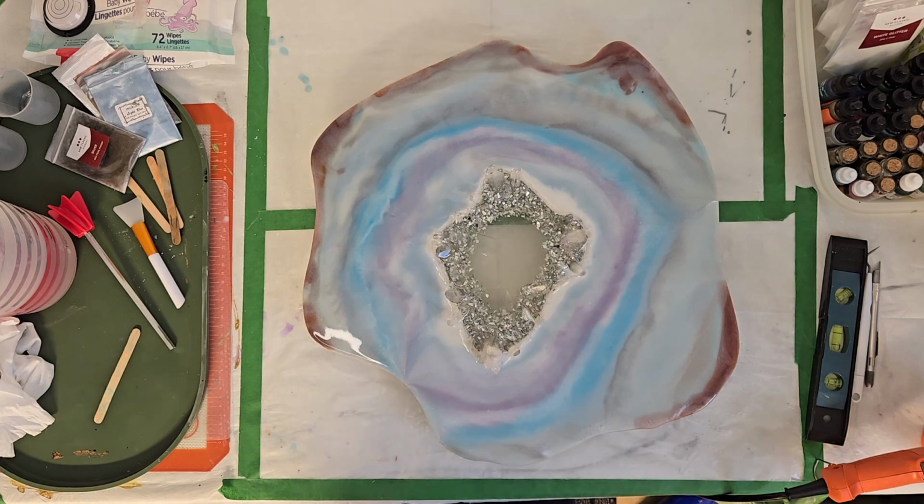And just as a refresh, I did that because I do not want cheap materials in my projects. Hot glue will deteriorate over time, and depending on the brand that you're using, it can yellow. Now just imagine you sold this piece to a customer and a couple years later they're getting a hold of you because their project is yellowing where you had hot glue. So we don't want that. You save yourself the embarrassment and the bad reputation from using cheap products. Take it out or just skip that step altogether.